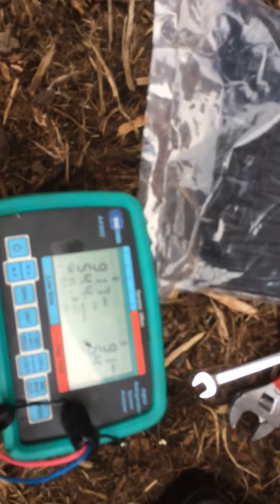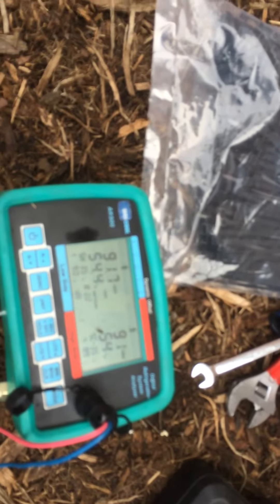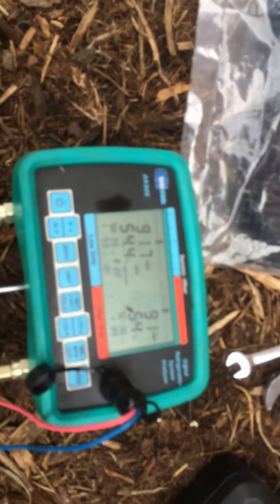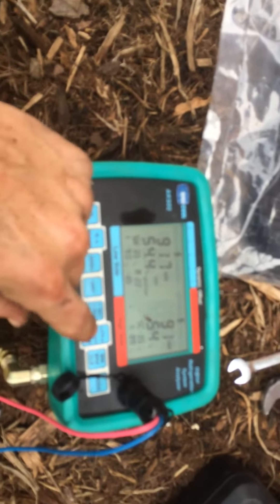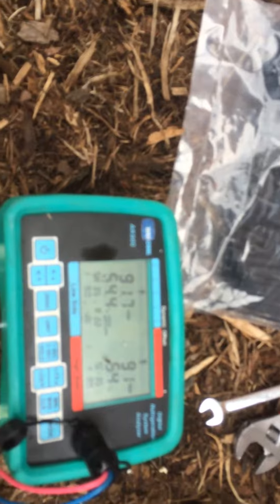My manifold isn't that tight — I know how much it leaks and it ain't much. I know the difference between my gauge leaking and a system leak, because if it was leaking it'd be going down quick. You can see this bar graph up here — I can hit hold, and if it was leaking you'd see it clearly.